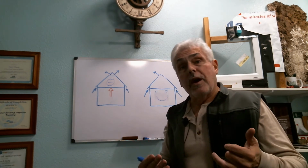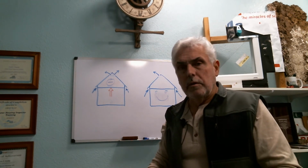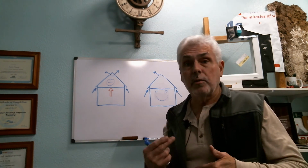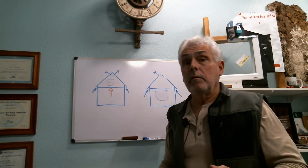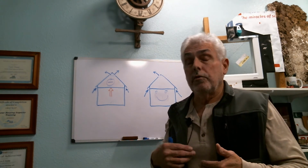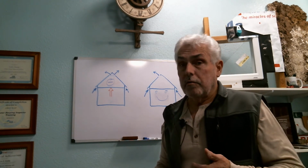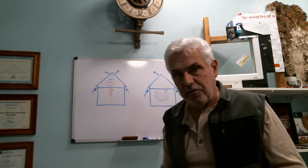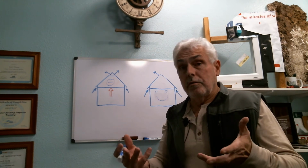So there's another factor. But it all even starts down below in the crawl space. If you have a crawl space where there's conditions related to the insulation, maybe it's incomplete, maybe it's damaged, conditions related to the vapor barrier in the crawl space, maybe there's water in the crawl space, maybe there's inadequate ventilation. All these things can change that equation and put more moisture into the structure.